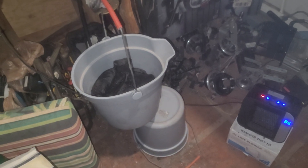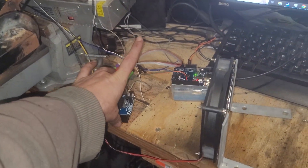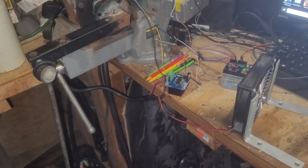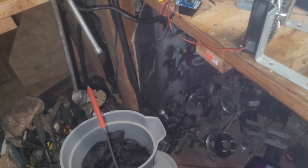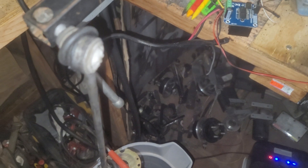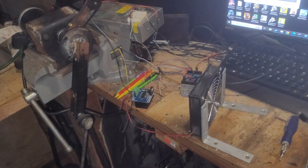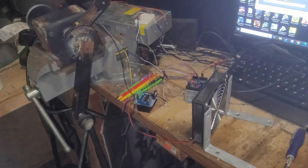This thing still hasn't failed yet — still getting warm. It's a pretty spicy heat sink right there. I think I'm just going to drop it now since it's getting real hot and it's held for a very long time. Okay, so that's the video of basically how I test the IBT2s under load on 24 volts. Talk to you guys later.